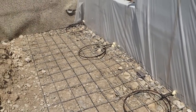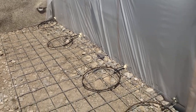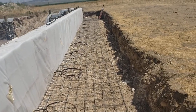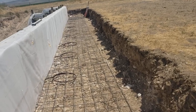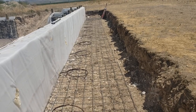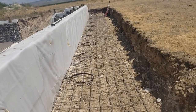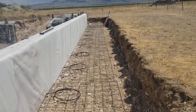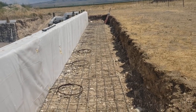The reason we're putting this anchor grid in — I filled in and backfilled onto this south wall, probably about four feet up. And what that's for is as we fill the backfill, it prevents the wall from tipping over. So I will take and put more fill, more fines now in this grid and put some weight upon it, and that'll help prevent that wall from laying over.